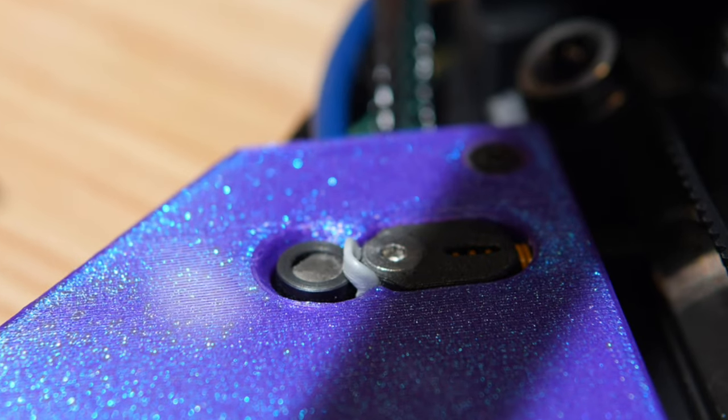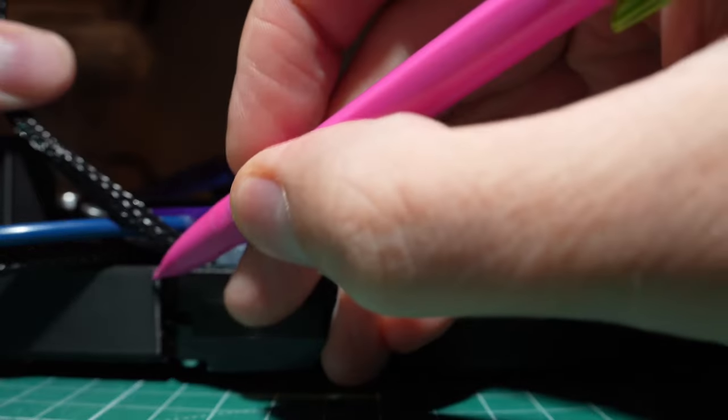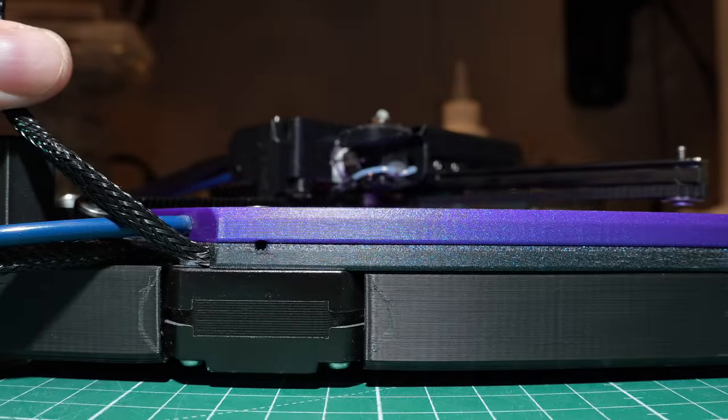Let's talk about what's left before the upcoming open source release. I mentioned the nearly overheating extruder motor — it works, but there's no margin there. It's one degree from buckling the filament at any time. This will be solved in maybe two ways. The most interesting but more optional way is to fix the bad gear ratio by using a reduction gear. The current design has its simplicity, but there's no denying the mechanical advantage of gears, which would cut the heat in half. The other fix — which I'm definitely doing right after this video — is to add an air channel around the extruder motor and remove the current exhaust port in the top plates, exhausting the air around the motor instead. I'm just going to add an air channel on all of them for good measure. The current design is on the edge of acceptable, meaning we only need a slight improvement, but I'll certainly give both a shot.